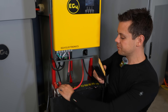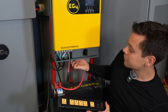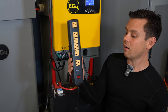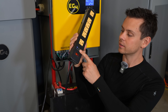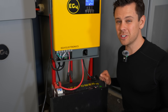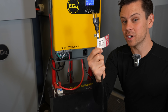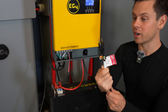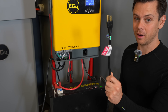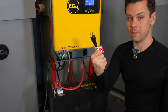To turn it on, we have to turn on the battery by turning on the circuit breaker, and then there's an on/off switch on the bottom of this yellow box. Now it's on — you can see the lights are on, so plug in an appliance. If you don't want to use solar panels, you can buy one of these at the hardware store instead and wire it straight into the input terminals on the front of the box. Then you can plug this into a wall and it will charge up the battery automatically.